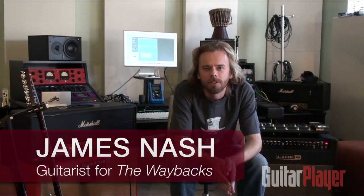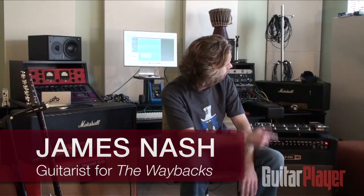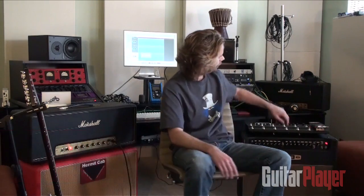I'm coming to you today from my little home studio to give you a demo of the new Line 6 rig. This is the new pod, the HD500, and this is the new tube amp that they've done in conjunction with Bogner. They call it the DT50. It's a digital front end and a tube back end. It's got EL34s, runs about 50 watts. And I reviewed this pair for the magazine and I was impressed with it.